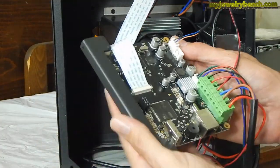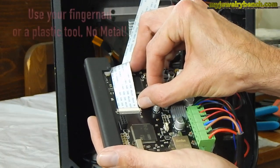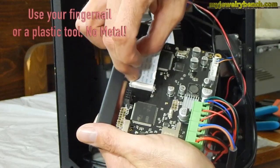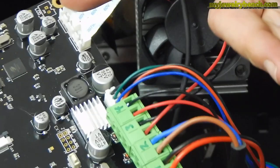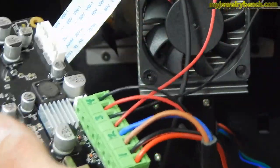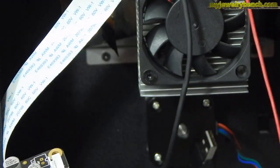With the motherboard completely out, I want to remove the ribbon cable for the LCD display. That has two little tabs — we're going to use our fingernails to push up on the little gray tabs on either side, very gently. Once those are loose, the cable should just come right off. I've got the stop switch off, the Z-axis motor connector off, one fan connector, the second fan connector, power, and the power for our UV lamp power modulator. There we have our motherboard disconnected.